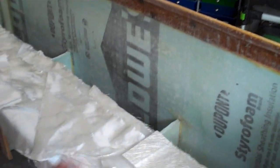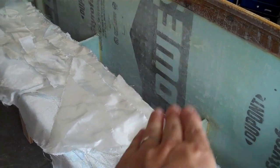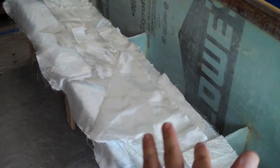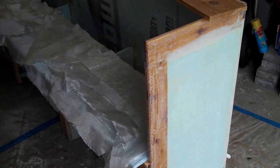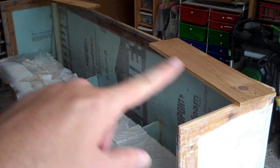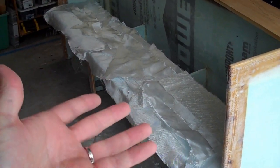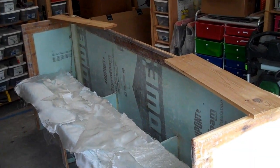My last layer will be those larger, mostly square pieces that wrap around the front. In most places I'll have two layers wrapping around; in some places only one, which won't be an issue because after I put the back piece up and it joins from the bottom, I'm going to wrap several layers around to join those two together. Then I'll put fiberglass across the top of everything as well. I'll put some boards up, move the pieces up there, epoxy them in place, then flip it over and stick it down.